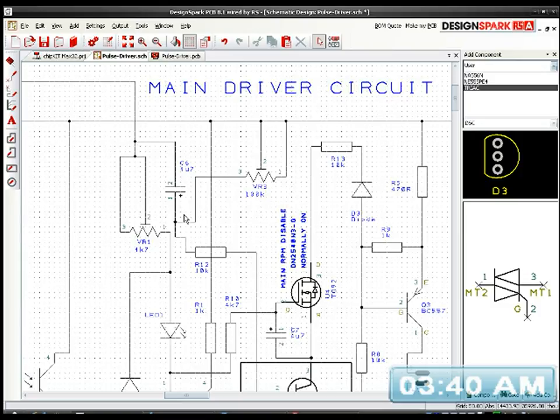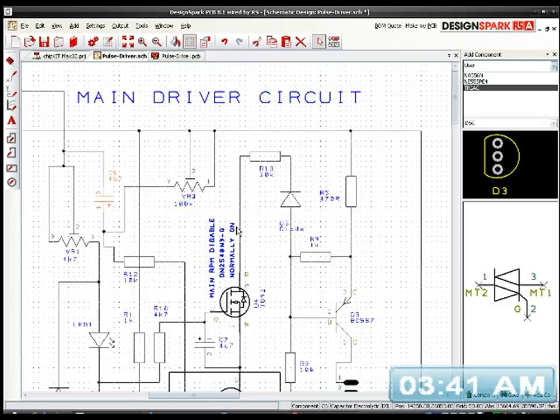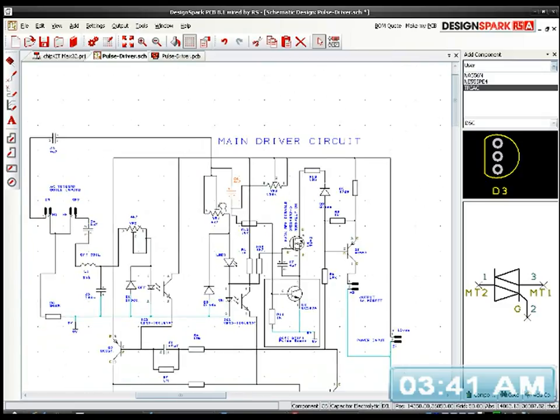Right. So it's basically going, so this resistor and that capacitor. So I don't need to put another N-stop resistor anywhere there, which is a good thing, because I've already got this one here and this capacitor is decoupling me on the other side. So what will that do when you first power it up? Well, when you first power it up with DC, there'll probably be a small amount of time for this capacitor to charge a little bit. I mean, it'll be grounded through that coil. So what will happen is the capacitor is flat.